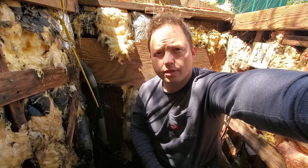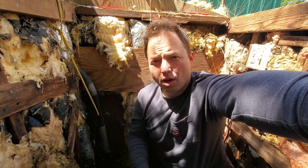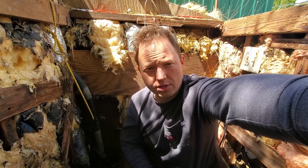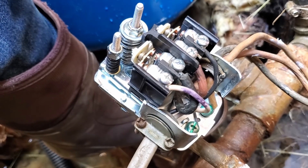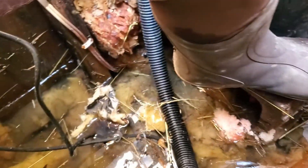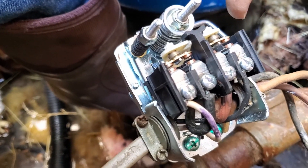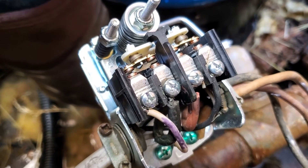Quick question — why are you adjusting the pressure on your well pump? Comment down below and let me know what pressure range you run right now and why you're adjusting it. Now, these terminals right here are live — 240 volts — and you're often in an environment that has good continuity to ground, so you've got to be super careful when adjusting this. What you really should do is turn off the well completely when you make your adjustments, verify that it is off, then make your adjustments.